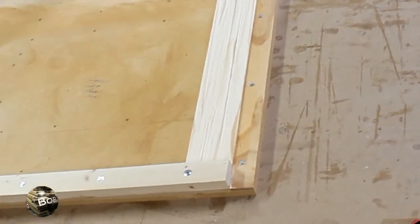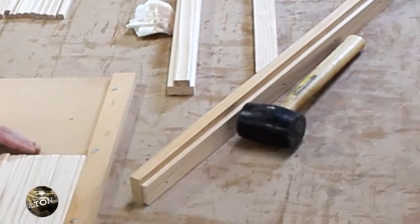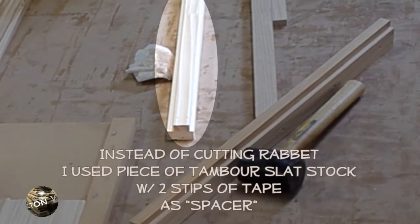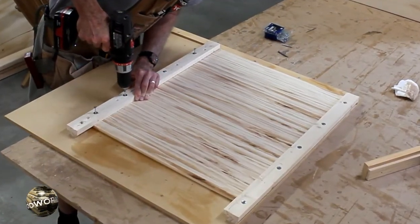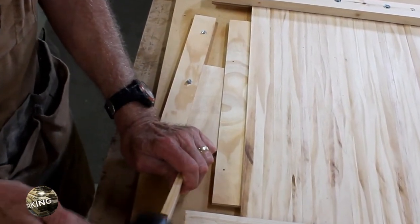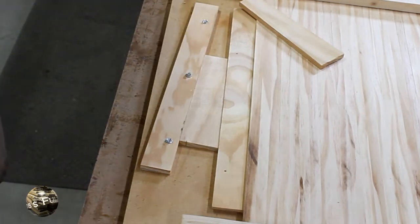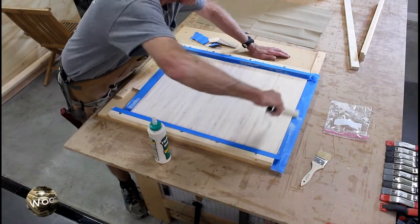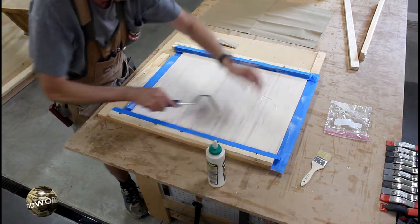To build the tambour door, I use a jig which is a half inch MDF with a solid top brace firmly attached. Each side holds the tambour slats firmly in place and has a rabbet cut the same depth as the thickness of the slat. After snugging up the two sides of the jig, I use a wedging device to drive the slats as tight together as possible so no glue seeps between them. Before applying glue and canvas, I tape about a half inch in on the sides and put tape across the top and bottom braces to keep glue from oozing out.